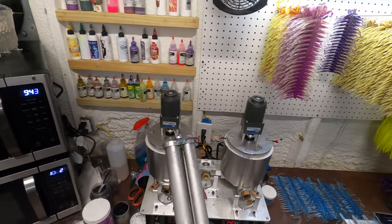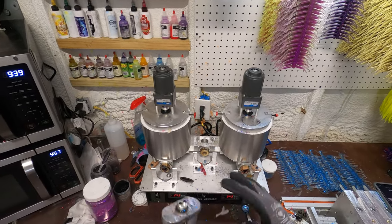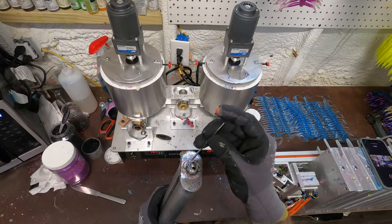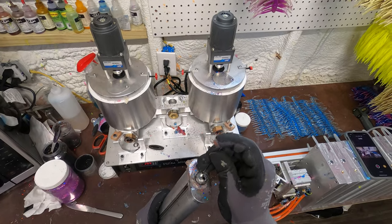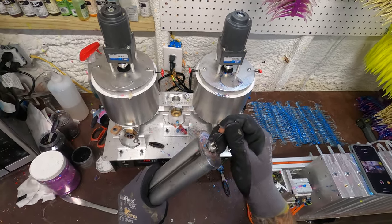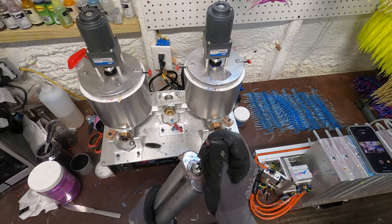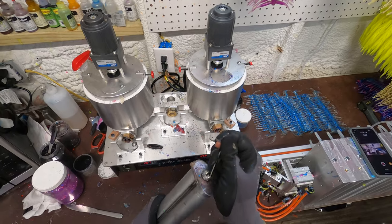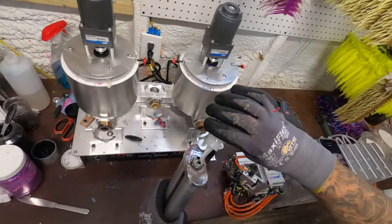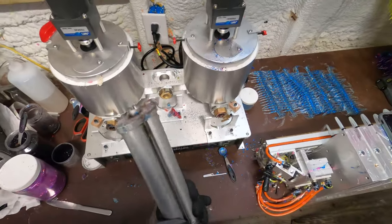You take your injector, a lot of the times it'll be sticky before you get going, especially at this low of a temp. I've got this little piece of an old Swiss Army knife that's broke off, just kind of a knockoff, but I stick it down here into the port because sometimes you have a little bit of plastic that'll get hung up in there and gives you a little bit of a problem when you're cleaning, but still, super easy process. Sometimes giving her a little bit of lube seems to help too.